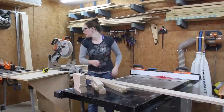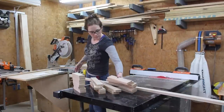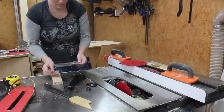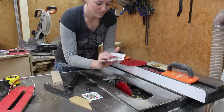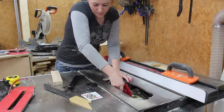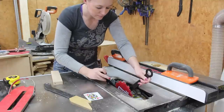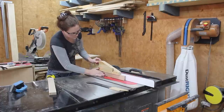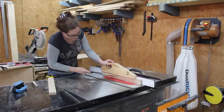These doors are going to be held together by tongue and groove joints. So next I moved back to the table saw and cut in a dado on one edge of every board. I'm going to be using quarter-inch material for the inside panel, so I put in my quarter-inch dado stack. I also put in two playing cards to act as additional spacers just so it's slightly larger than a quarter inch. And then I started cutting in the dados.